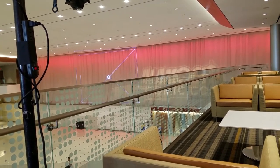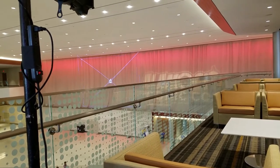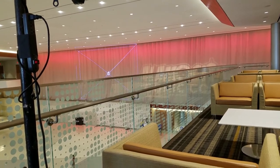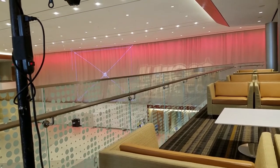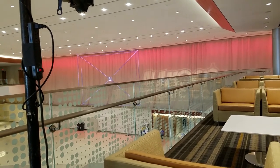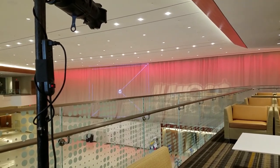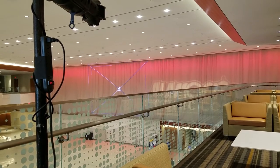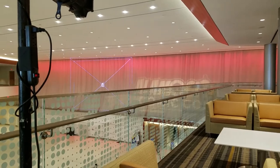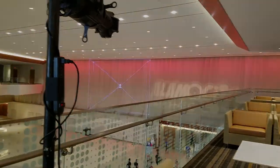Now I'm going to adjust the left and right. This isn't going to be perfect — I'm going to fine-tune this with geometric correction using the crosshatch pattern. But the center X and the numbers are now roughly centered. You can see that scan zone 6, which is scanner number 2, is slightly larger than scan zone 1, which is exactly what we want.